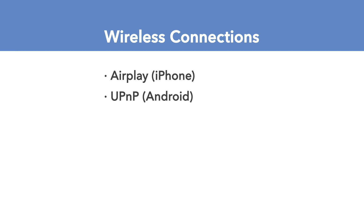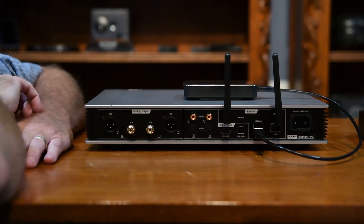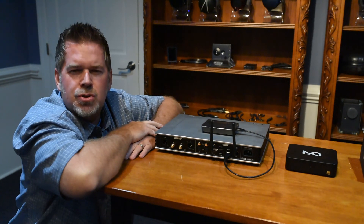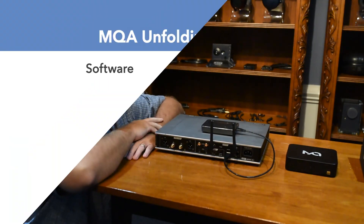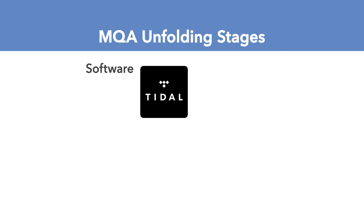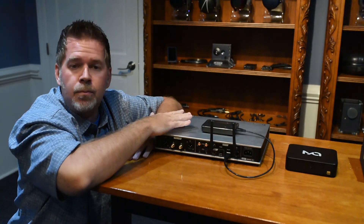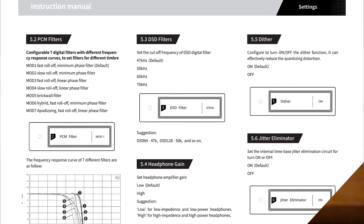It's very flexible. Matrix has their own Android app and they're working on an iOS app so you can send music and streaming services from your Apple iOS device to the Matrix. We then have the I2S HDMI input and next to that the USB-B input for your computer, using an XU216 XMOS processor. This processor allows MQA unfolding — there are two unfolding stages: your software such as Tidal does the first unfolding to get you to 24/96, and then hardware unfolding handles higher resolutions. The Matrix products come with MQA unfolding to get you 24/192 and potentially higher. The unit is firmware-upgradeable for new formats and improvements including changing dithering curves.